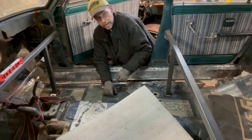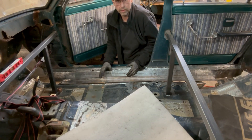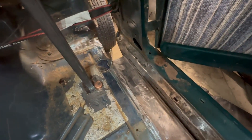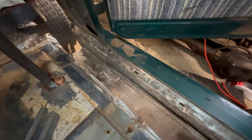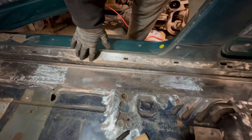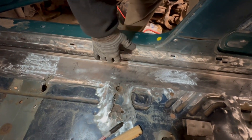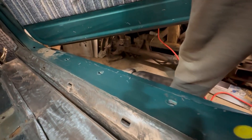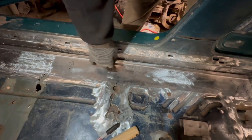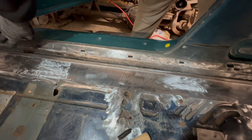There's definitely a bow in the center of this piece. It's also way longer than it's going to be finished, but I wanted to do the whole piece — I wasn't sure how long I'd actually need. It fits out the front but begins to bulge at the center. Upon further investigation, I realized this has a bow because this piece I welded in is dipped, so I'm going to have to try to move this slowly and stretch it.